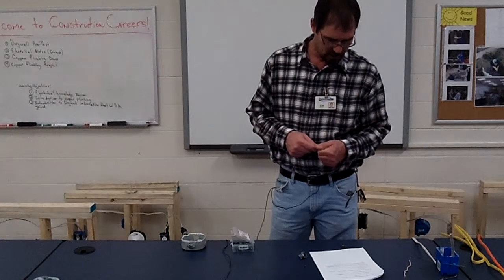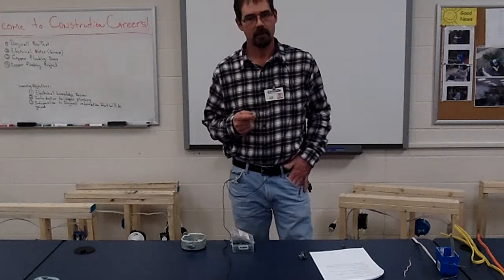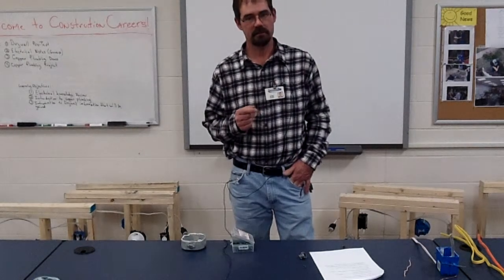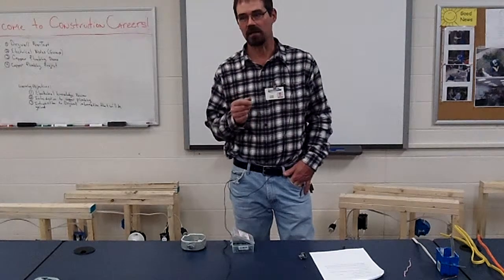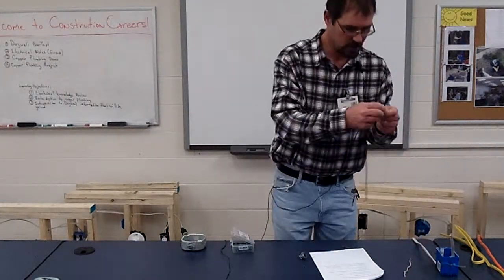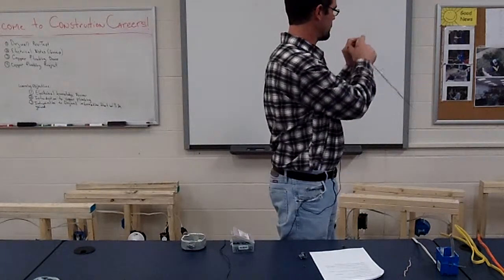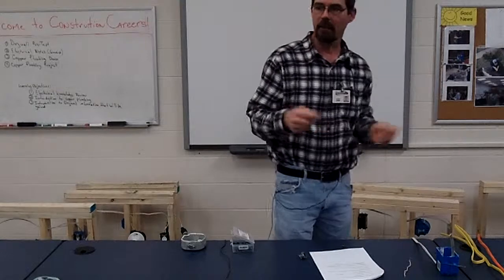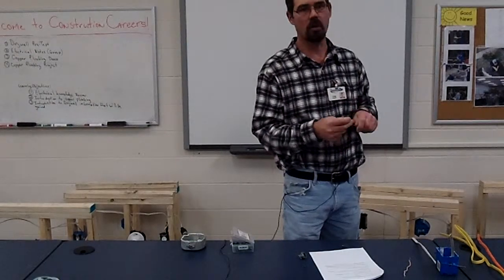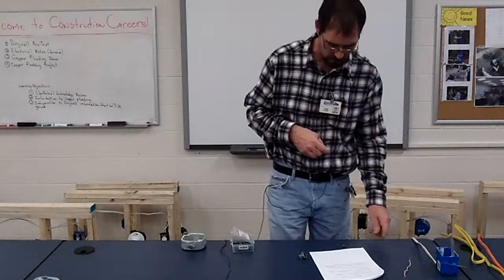Number sixteen: the curl must be attached to the screws on the device in a clockwise direction. That curl has to go like a clock spins on the screw. Remember, if the device is oriented side to side, that changes the direction you're looking — but it's got to go on there clockwise.